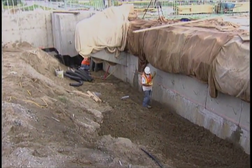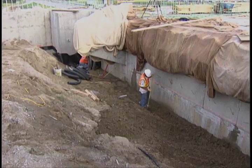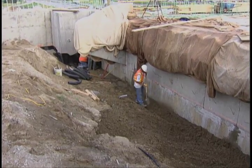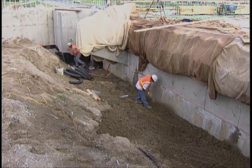The process is fairly simple. It consists of shaping the subgrade 4% away from the back of the abutment wall to keep water away from the footing, and 2% in the direction of the sub-drain.